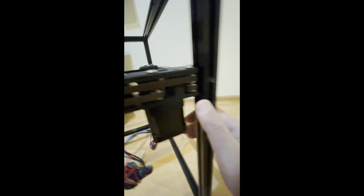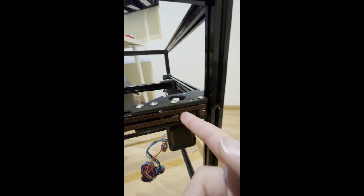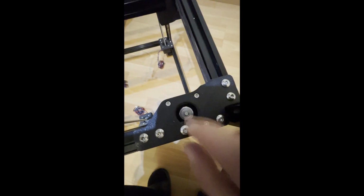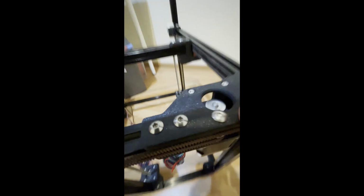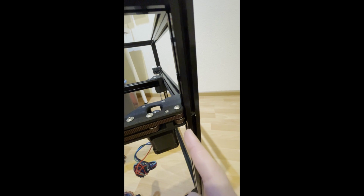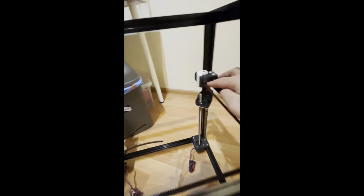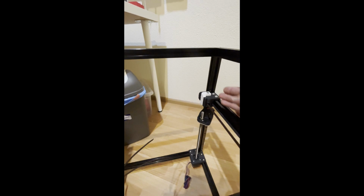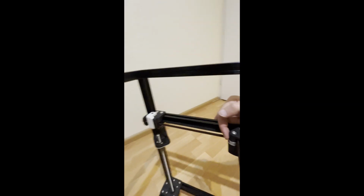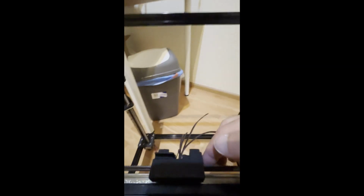In the other drive, again there's a pulley, so I need to turn it. It's turning around this pulley and goes to the motor's pulley, and this bottom belt is turning around the motor's pulley, coming back to the idler, and from this idler it's going to the front idler. In the front idler there is a bearing stack, it's making the U-turn and coming in here to this pulley. From this pulley, it's going back to the tool head.